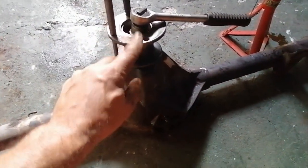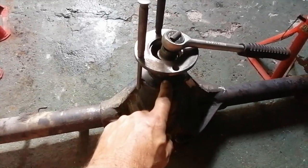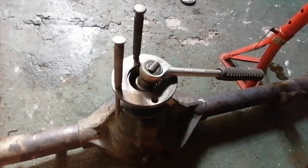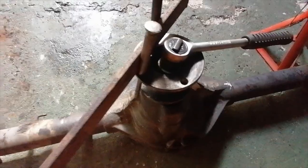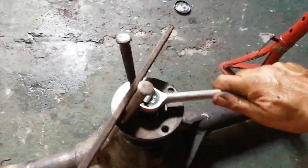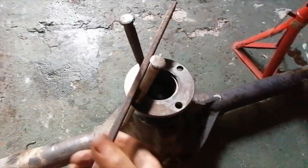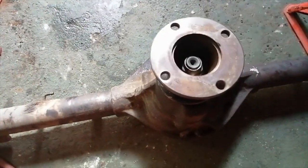Okay, so I put it back on the ground and then I inserted the outer race and I put the pulley on. I didn't put the seal in here yet, so I'm just pulling it closer. Okay, I'm almost there, so I just put this thing in here and I'll start pulling it. It's actually quite tight already, just a matter of torquing it now. She's in. But I don't want to torque it because, like I said, the seal isn't in.